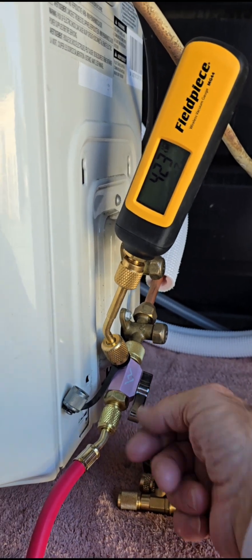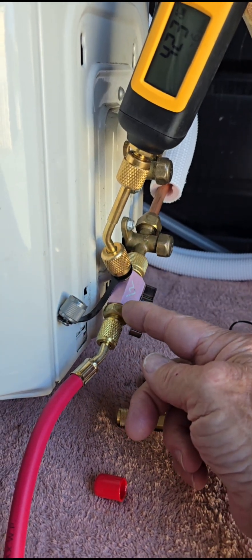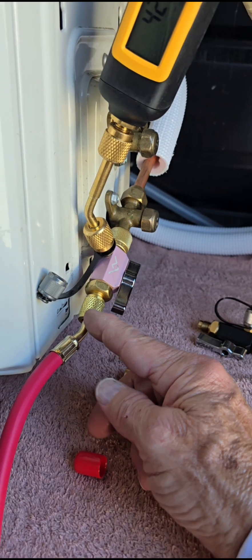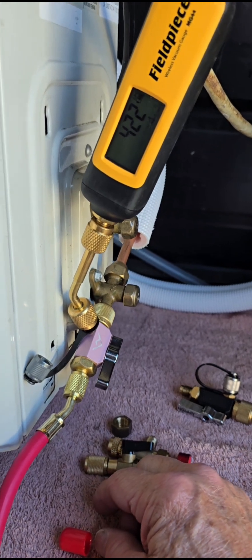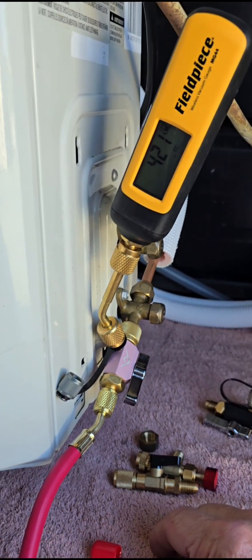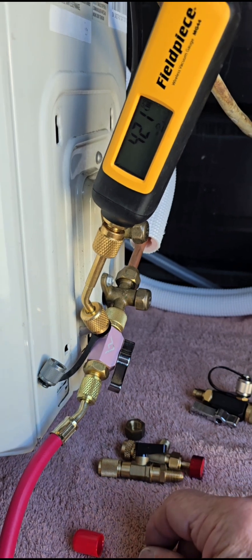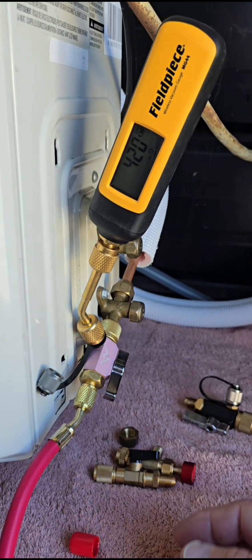When I opened it, think about it — this is under vacuum pressure. When I opened it, it shouldn't have even gone up. The valve is right here and it should just suck right into the vacuum, like a shop vac hose — whatever you moved would just go down into the vacuum and this thing would be none the wiser. But instead, that little tiny bit of moisture and non-condensibles could ruin a good system. Whatever tiny bit was trapped on that valve — think of little air bubbles, little tiny particles — that's how much it went off. That's why it's super important to get a micron gauge, because that's the only thing that shows that kind of infinitesimal problem.